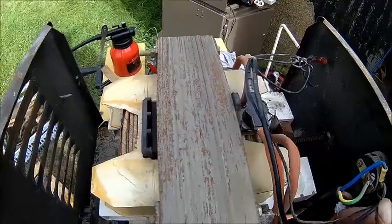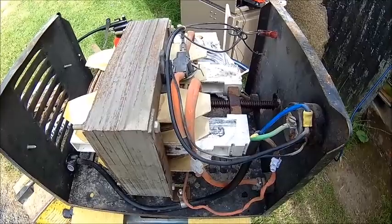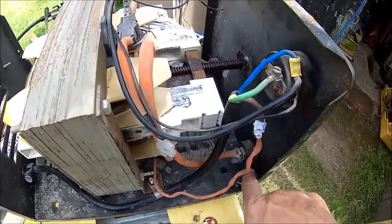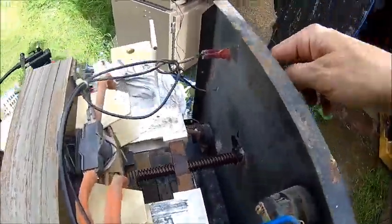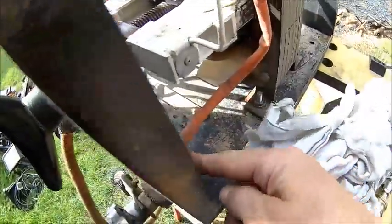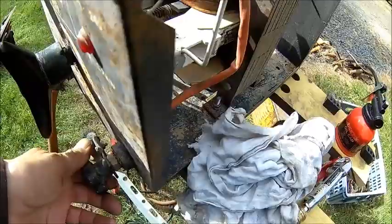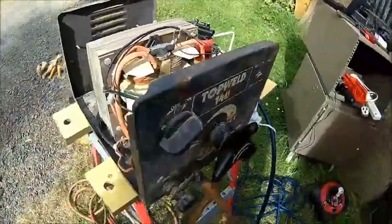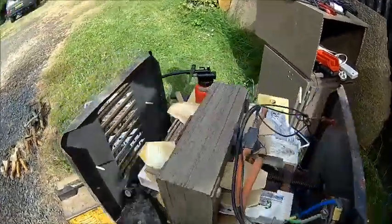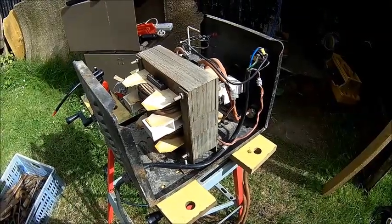I think it's fairly safe to turn it on. We need to change the plastic spacers and also that bolt — I don't like that, it went really hot, so it's not making good contact anymore. So we'll change the whole bolt. Apart from that, yeah it looks tatty but I don't care as long as it works. There's no reason why it shouldn't work because the transformer looks very good once the dust is out.